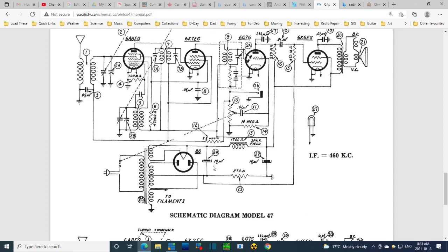Very few old radios have original filter capacitors — if they do, almost always these capacitors are shot badly. If you have a power supply that uses a resistor instead of a coil here, the capacitors become much more critical as the filter, and they're usually much larger. If they're weak, the radio will hum badly. There's a very curious resistor here doing a job that's not easy to initially figure out. The important thing to note is where the ground point is made in the power supply.